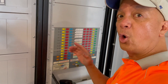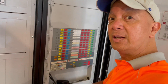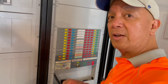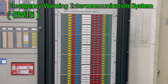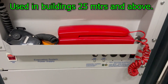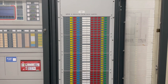In this case all of the blocks go off at the same time. But if this is an EWIS, it will cascade from one level to another — plus or minus two levels starting from the origin of the activated alarm. This is the EWIS panel — Emergency Warning Intercommunication System — it has a warden phone, which is the only difference between the EWS and the EWIS.